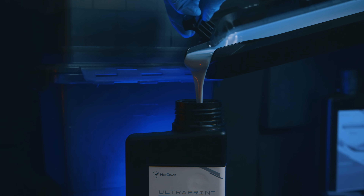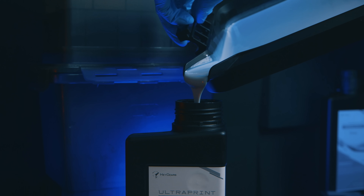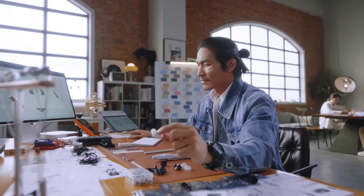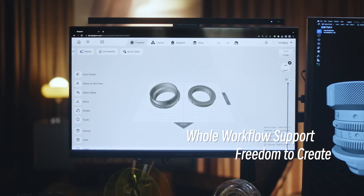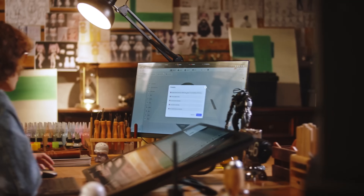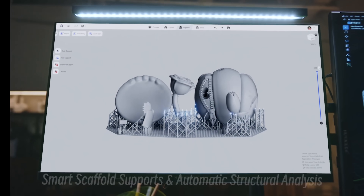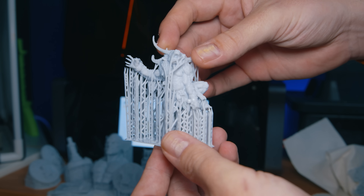When you want to remove it, just lift it out — there's a socket inside which closes a valve and stops it leaking. Hold it for a couple of seconds so the dregs fall into the vat, then move it out, clean the vat, and move a new resin in. This is where they've nailed it: because they know the resin you're using, all you need to do is drop a model into the slicer, say 'orient and support this,' tell it what resin you want to use, and it'll do everything for you and result in a perfect print.